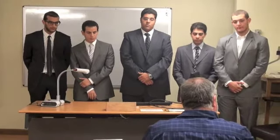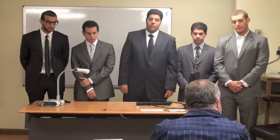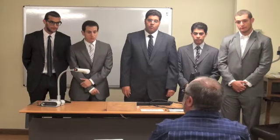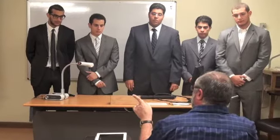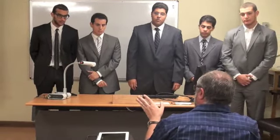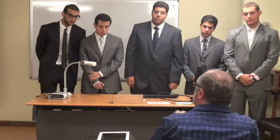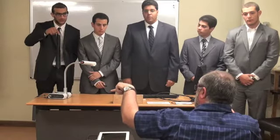Okay, I have some technical comments. I mean, the presentation is very good. We thank you for that. But please take care of the span, because you didn't mention anything about the span of the beam itself, such that you have moment failure. And also the loading. Are you going to put concentrated loading? Yes, concentrated loading in the middle.